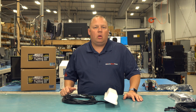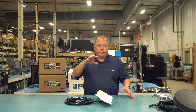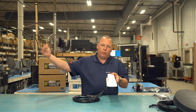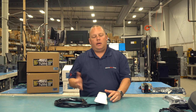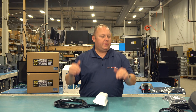The Belgian Shepherd is technically a ground-plane-optional antenna — it will perform and work without a ground plane. A ground plane, simply put, is a sheet of conductive metal, typically aluminum or steel, mounted below the antenna. It helps when radio waves are traveling horizontally across the earth by bouncing them into the antenna, improving overall performance.